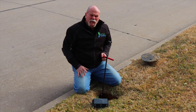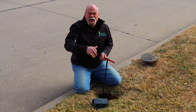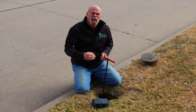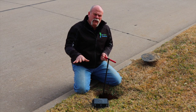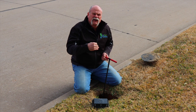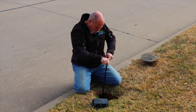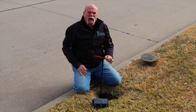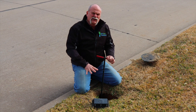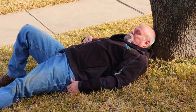Now that we've put the gauge on and we know what the pressure is, all we're going to do is turn the water off. I've got another video about how to turn the water off to your house — go watch that — but literally you just reach in here and turn the valve off. Now that I've turned it to the lock position, the meter's off, everything's closed, and my house should not be losing any pressure at all.